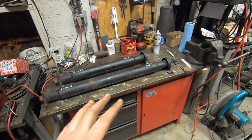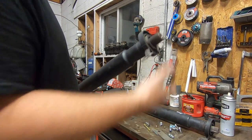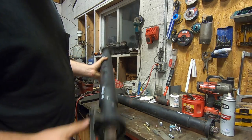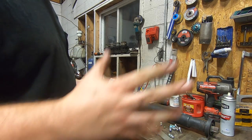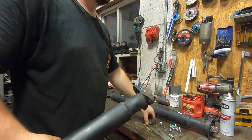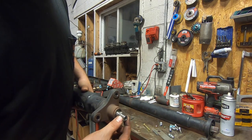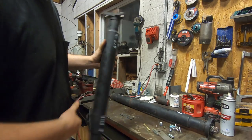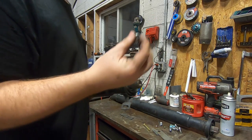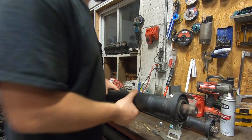I'm going to show you how I build a fixture — I do this without any special tools. First things first, I need to be able to spin this driveshaft between centers. You can see it's got cylindrical features in the front and the rear. If I had a lathe, I would chuck this up between two centers, dial indicate the OD, and see how straight and round it is. I don't have that, but I do have some hydraulic fittings with a nice tapered cone that will help me center up on the ends of the shaft. I got a couple different sizes to fit both features. So let's make a fixture to utilize those — that way I can rotate this, put an indicator on it, and see how round it is from the factory.